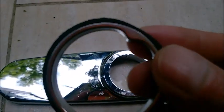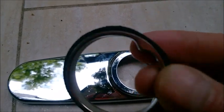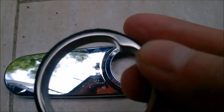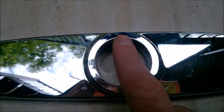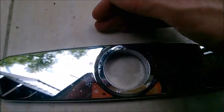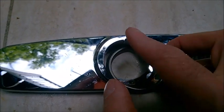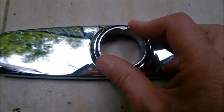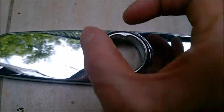This is how the washer and rubber seal go: notice this is the top — the full side — and the one with the hole is the bottom. That notch goes into this bump, which is behind the faucet. This is the front of the faucet — you place the two notches together, match them, and they prevent the plate from rotating.